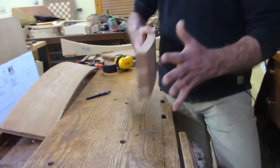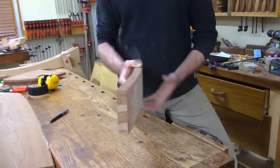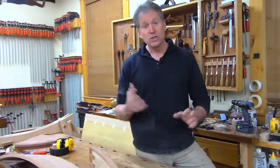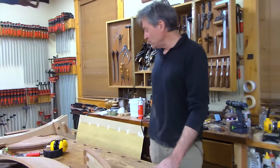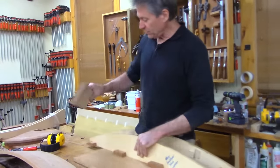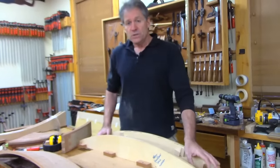Now, you can just bandsaw it to a line and then do a lot of fussing and try to line it up right. You might have some success there. But if you're doing a whole chest of drawers, it has been worth it in the past, I have found, to make a jig and use your router to create a beautiful smooth arc. Here's an example. Now, I've modified this a little because I want to show you with a short one. This is a jig that I made for a bowfront chest of drawers that I did not too long ago,